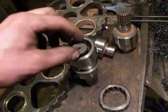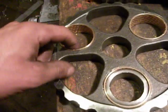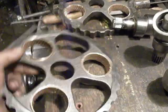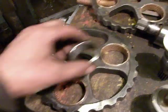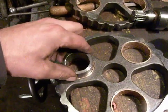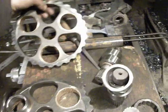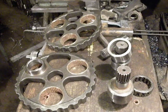I made a bush, pressed it onto this shaft, and the result is like so. Into this gear I put bronze bushings and pressed a bush into this bore, because these bores were also a little bit damaged. This needs to be adjusted a little bit with sandpaper or a file. Thanks for watching, good luck, and have a nice day!